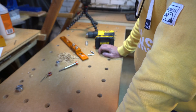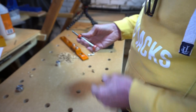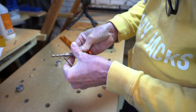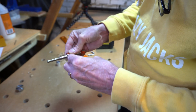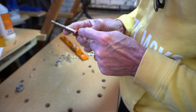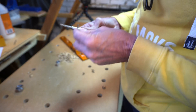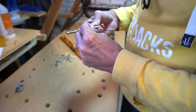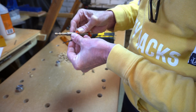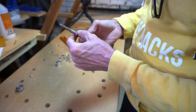One thing I don't like about this jig is the depth stop. It goes on there, you tighten it up to the depth, and in theory the drill bit just punches through the top. The issue is the same one I have with anything that has a grub screw — it doesn't take long for the allen key to start to burr out. If you tighten it what you think is tight enough without stripping it, it's actually not tight enough and the depth stop ends up sliding up and becoming useless anyway.